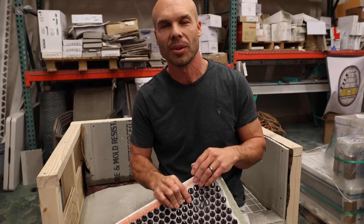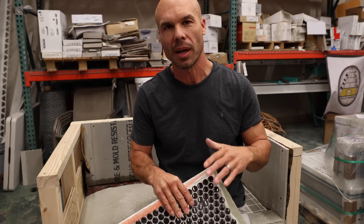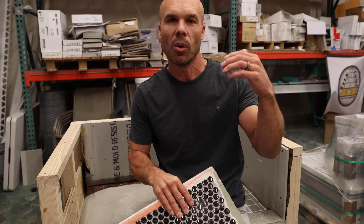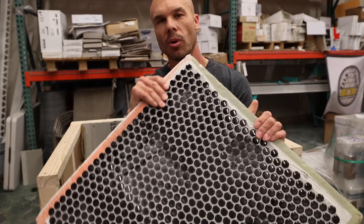In conclusion, you can see that dropping those heavy objects onto shower floor tile no matter what base you have will damage the tile, but it won't punch through the waterproofing membrane like in one of these foam pans.